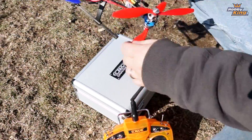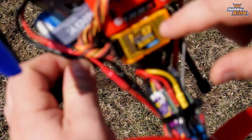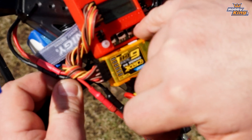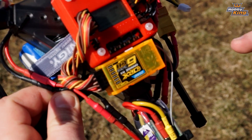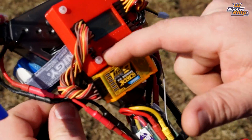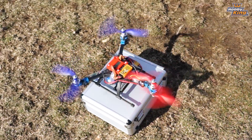You load up your KK2 menu here — you'll find the fourth option down is stick scaling. You want to go in there and crank those up pretty high. Default for a Y4 was like 50; we've gone ahead and set them all the way up to 100. That makes this thing a lot faster and a lot more reactive, which I'm going to show you.